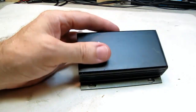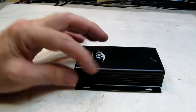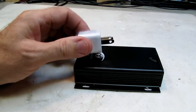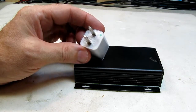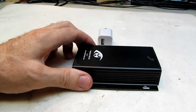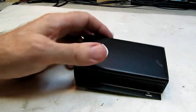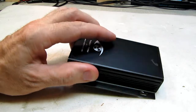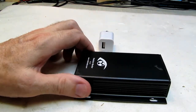It shows up on a world map — you can go to uradmonitor.com. I thought it was a fantastic idea and jumped on board and bought one. Within a couple weeks of it being connected, it went offline and went dark. I fiddled around and checked the Chinese power supply and found it was only putting out about 4.5 volts and was very noisy — the filtering was terrible. So I threw that away and plugged in a very high-end commercial 5-volt power supply with virtually no ripple.